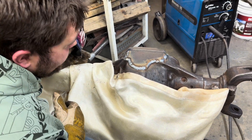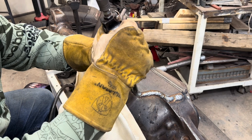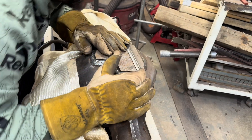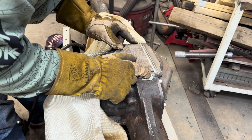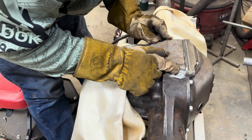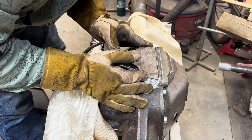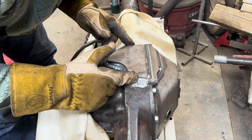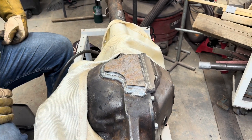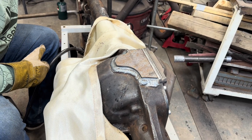I think that's pretty sweet. I don't know if this helped, but this is what I read. I'm going to leave that ledge in the front to weld to and not butcher the face — the diff cover mounts. Maybe I'll back it up a little bit more and try to make that even. I've got to stop touching that hot top. I think like that would be good. Let me lay a tack or two in the back here and then get going.